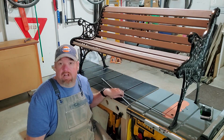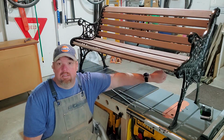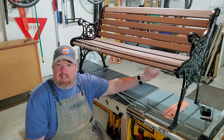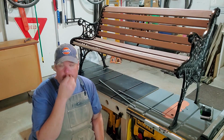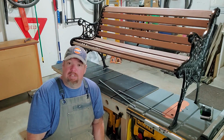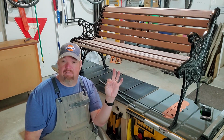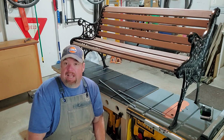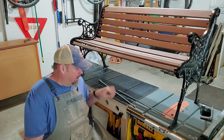And what I'm going to make it from is a couple pieces. Originally, this probably would have just had a tube across, a hollow steel tube with nuts welded in the end, and then you bolted it on from the end. Probably what happened, because it happens every time they build something like that, the little nut where it's welded into the tube breaks off, and at that point the whole bracket is useless. So I'm going to make it, but I'm going to make it a little differently.